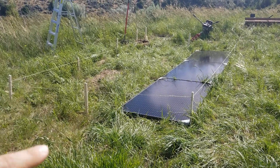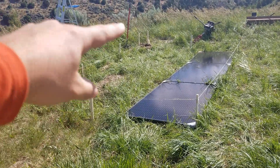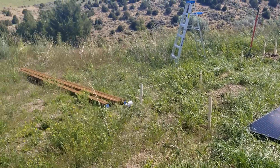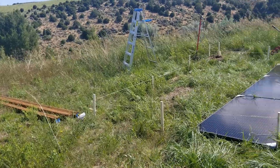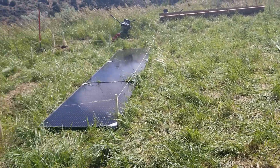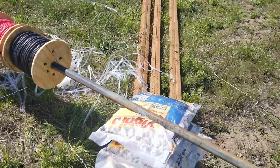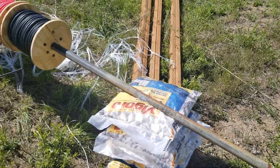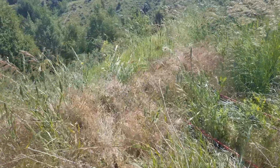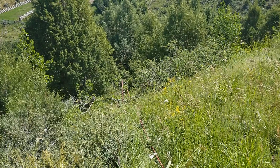Okay so we've got the area mapped out for the ground mount. We're going to have 4 rows of 3 posts — 12 posts total. We've got our posts made up here that are going to go in the ground, and now we're going to send this spool of wire all the way down to the cabin. You can see we've put these spools up on a big irrigation pipe that was up here on the property, and now it's going all the way down the hill — they've got about 300 feet more to go.